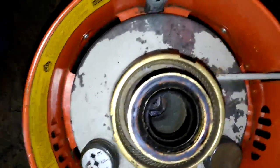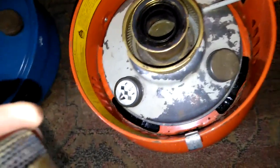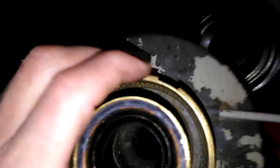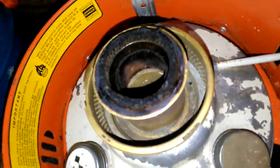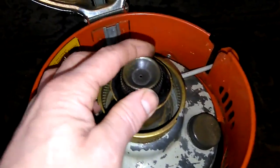in an auction. This is also blue flame, same size, 2-inch wick, hole straight through the middle. Need some fuel in that one. And you see the hole straight through. They are blue flame burners, and if you're going to have it in your house, that's what I recommend you get. There are smaller than these, and these are 2-inch wicks. You can get up to a 3-inch wick.